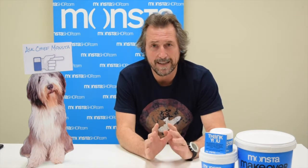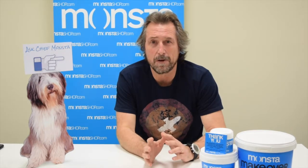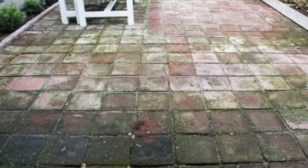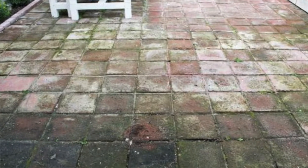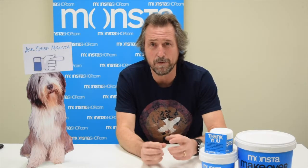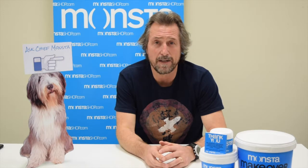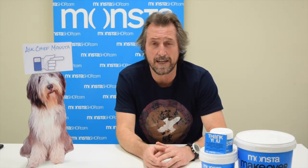So once you've done that, you need to look at all the joints of your pavers and clear the moss and the weeds. If you have had weeds that you haven't taken care of, maybe a week before, get a weed killer and spray that first. Otherwise, if it's easy to remove, get the real heavy weed growth away just mechanically, remove it, and make sure then you've got an area that you can just clean the algae and moss stains off the pavers very easily.